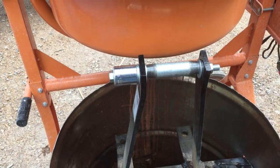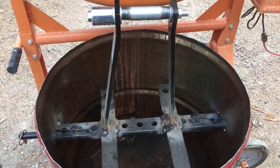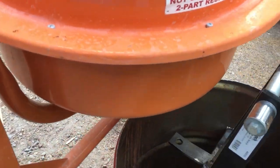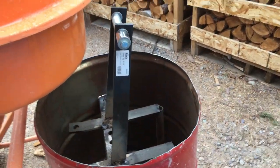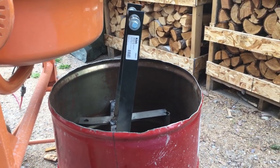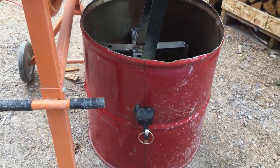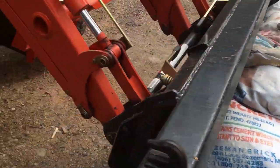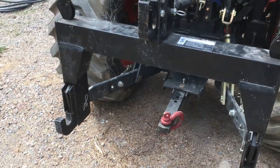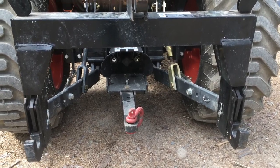I got a six-inch pin in there to replace that. When the concrete sets, I just set this down with the tractor, set it on the quick hitch just to check it out — perfect. This thing is not straight up and down. I didn't want to take my hitch off my draw bar, so when I set this down I'll have to set it on some blocks so it's straight up and down. The quick hitch is kind of bulky, as you can see — I just got it where it fits in there and I didn't have to notch it out.